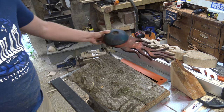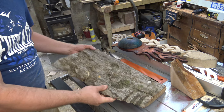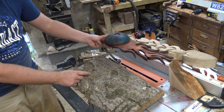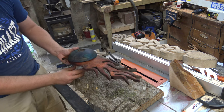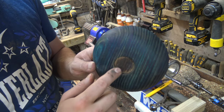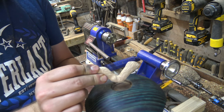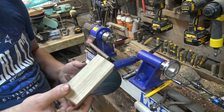For the base, to keep it with a tree theme in the form of earth, I'm going to use this little slab. We'll cut this down and turn a transition piece to go into the bottom — so it'll hopefully look like it's levitating at the end. We're going to need to wood-turn the transition piece to make an interference fit. I'm going to use a little off cut of tulipwood I've had knocking around. A quick way to find the centre is to use your finger as a gauge on all four edges — in the middle of that area is your centre point.